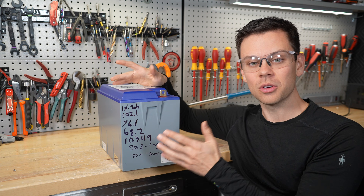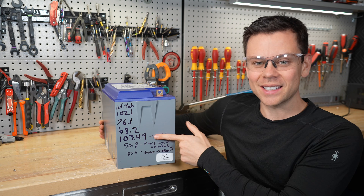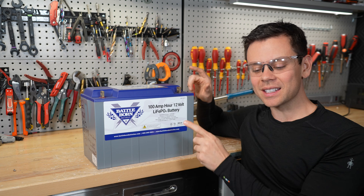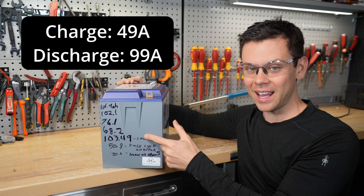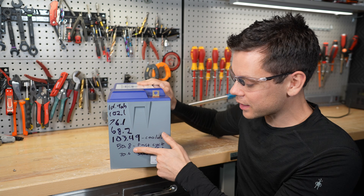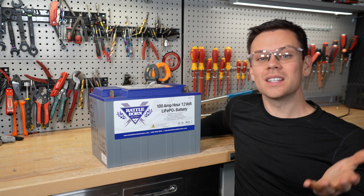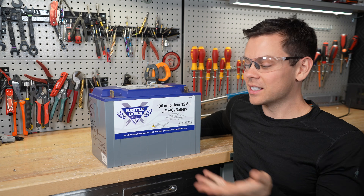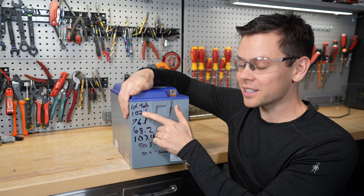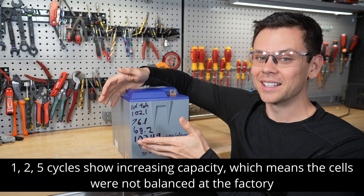This battery has a high temperature disconnect and it shuts down, which is why I can't get full capacity during back-to-back testing. Keep in mind the cycling is at 49 amps charging and 99 amps discharging — as advertised — but doing it back to back you won't get full capacity. This is wintertime in a shop that stays at 75 degrees year round. Between the first and second test I went to sleep, it cooled down, and I pulled full capacity. Then the very next test it disconnected short. If this is certified to a UL standard, how did they not catch this?